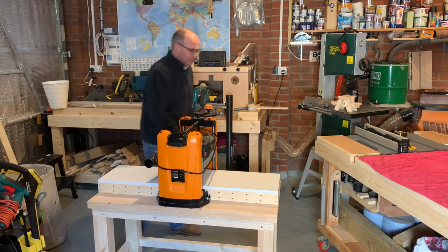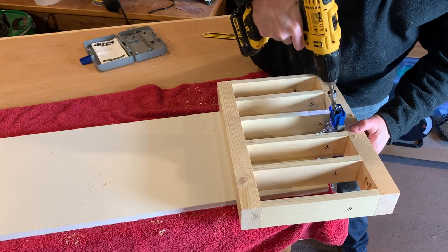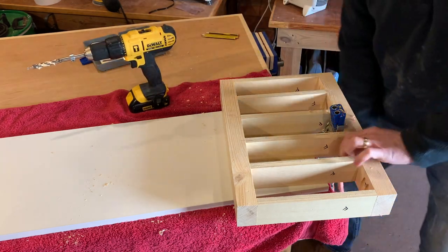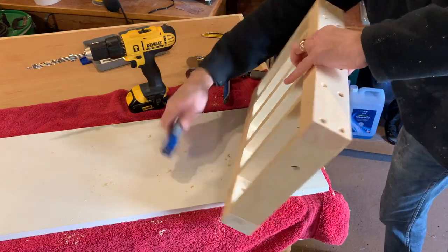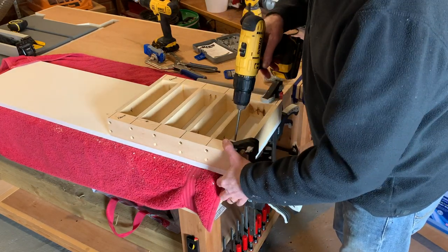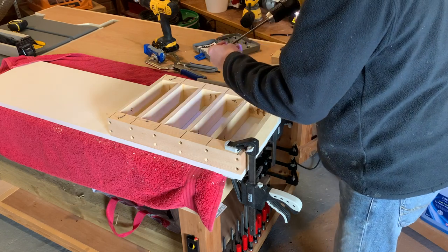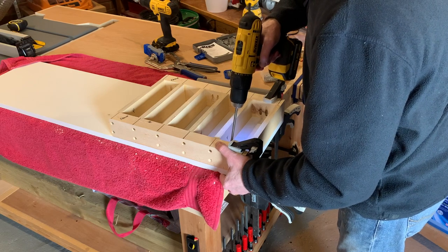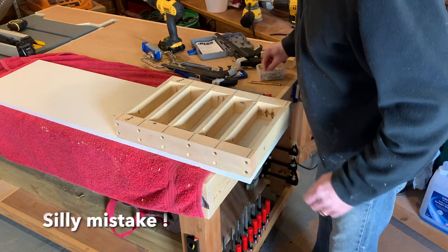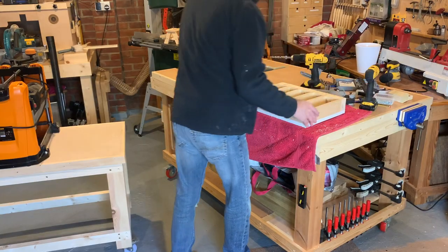I was thinking about leaving the overhang but I know I'll catch myself on it, it will get knocked about and chipped, so I'll make it flush and trim the end off. With this melamine board they do it in two types - you can buy 16mm and 18mm, and you can buy the flat shiny surface or the matte with a slightly dimpled effect. I've gone for the shiny surface so the wood should slide through much easier. The sheet's now cut down to size - fixing it on using pocket holes again because I don't really want screw holes in the top of the melamine.